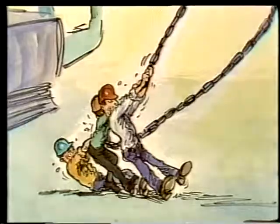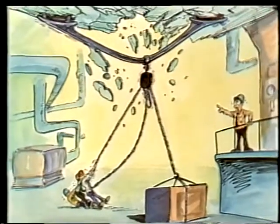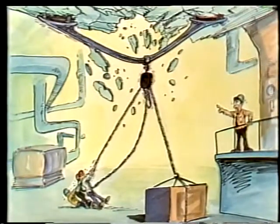Sometimes you have to fabricate something special. You might have to weld on an additional pad eye, or even install a special beam to bear the weight of the load. There are several possibilities. But there's really only one main consideration. The overhead and your connection to the overhead have to be able to support the weight of the load. It's generally healthy to allow a substantial safety margin, unless you're planning to demolish the building anyway.